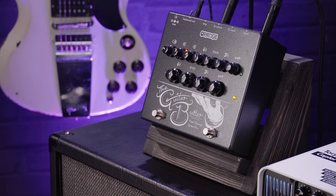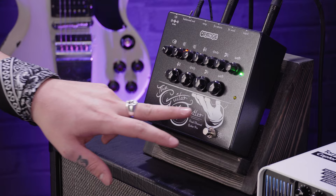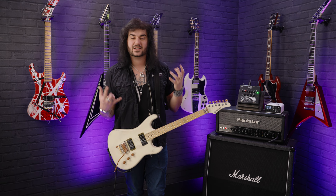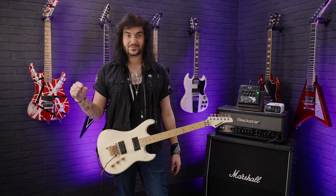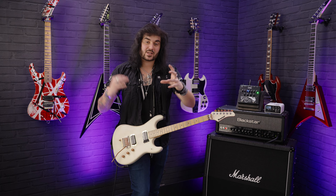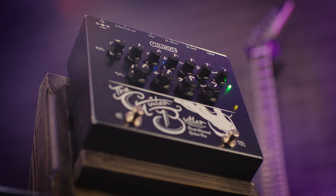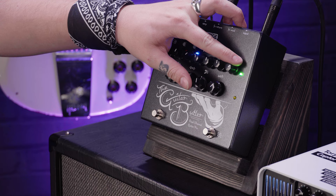That's the clean channel. As you can see from the lovely Orange graphics, there's bass, middle, treble and volume on the clean channel. On the overdrive channel there's bass, middle and treble, but also a gain control on the right. The gain on the clean channel doubles as the volume — the higher it is, the more clean gain you get, like old-school Laney DC-ish gain. There's also a three-band EQ and a presence control on the left, which has a little fist graphic for some reason. There are two volumes on the overdrive channel — the switch on the left toggles between them — so you can use that as a boost for solos. Both circuits are exactly the same; the red and blue just switch between the volumes to make one louder than the other. There's also a ground lift on the top for when you're using the XLR out and there's a bit of ground hum.